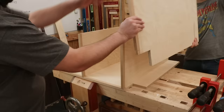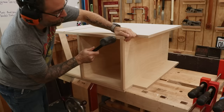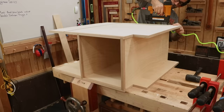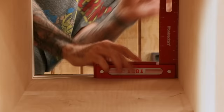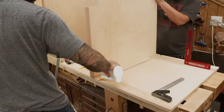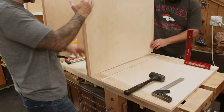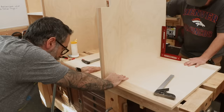I'll do one section at a time to make life easier. With all the joints seated, I'll pop in some brad nails — and by some, I apparently mean a lot. The piece is then set upright, clamps are added, and nails are added to the other side. Even with the brad nails in place, it's a good idea to check for square and fix any issues while the glue is still wet. Next, we'll glue the large shelf to the short divider upside down, making sure the divider is fully seated in the dado and that it's nice and square.